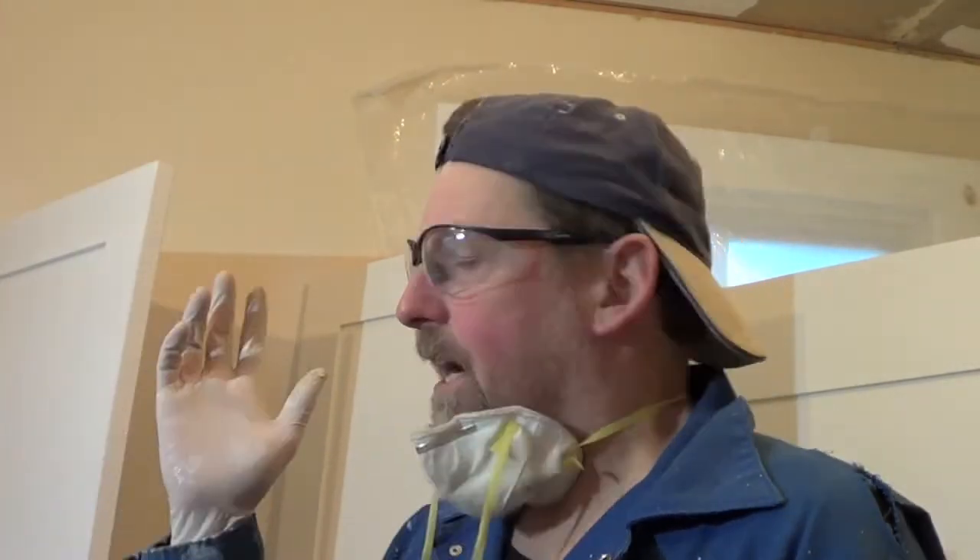That's the first cut on these doors. Just like it says on old spray cans: two light coats. I kept the fan width medium. You spray all the stiles and rails — that's the frame of the door — first, just nicely. Obviously the key is no puddles, no runs. You basically start at the top and work down; at doors I generally start at the top and work down. Then you do your frame first, then come back and do your center panel — nice and even, a light coat.